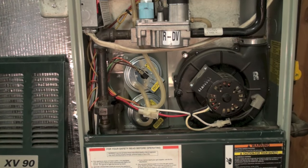This is about pressure switches on gas furnaces — what the correct vacuum or pressure should be, what causes pressure switch problems, and why a pressure switch is put in a system. It's primarily put there so that the furnace will not operate in unsafe conditions. A pressure switch is usually not a problem; it's an indicator of a problem.